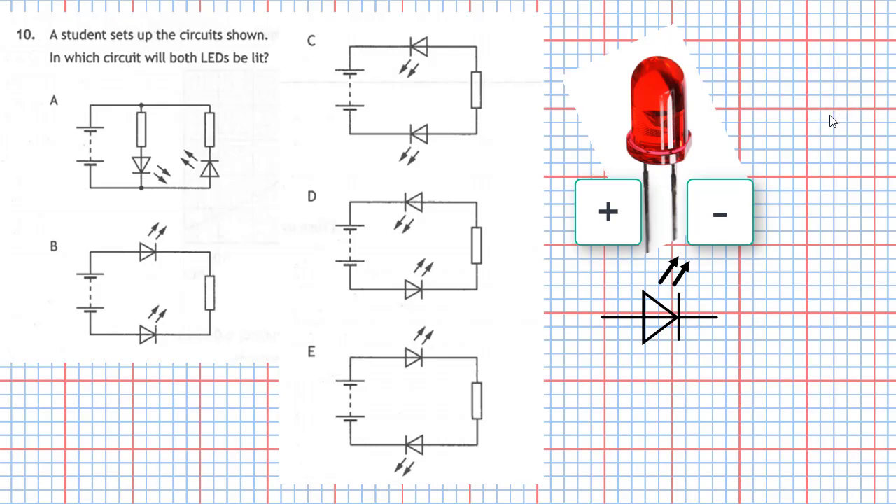On the real LED, the right-hand leg — the part which you want to connect to the negative part of the battery — is shown by a flattened side in the casing. The symbol for an LED is made up of a triangle and a vertical bar joined together with a horizontal line going straight through, representing the wire going through the LED. Two arrows indicate light given off.